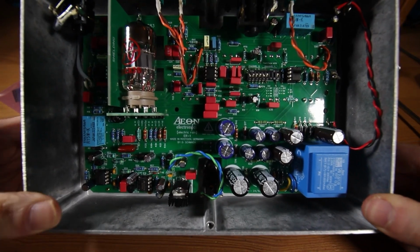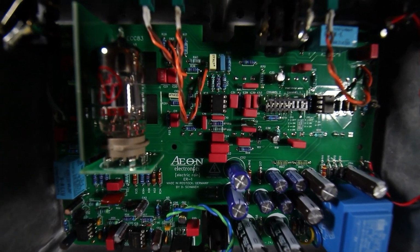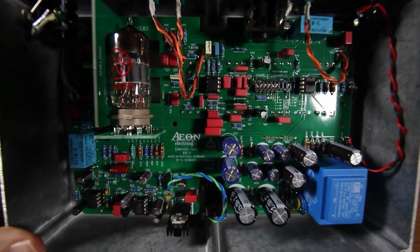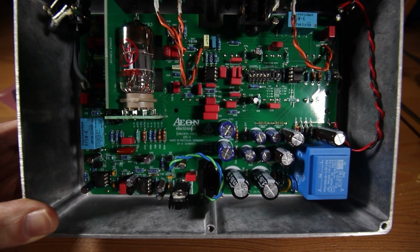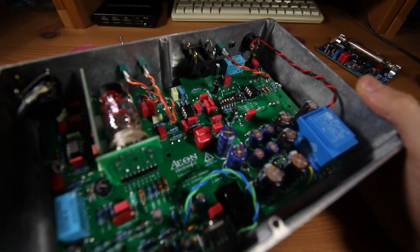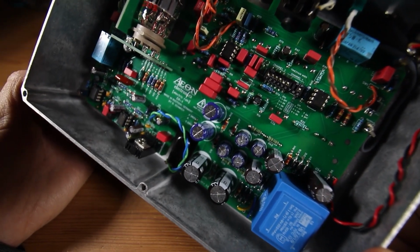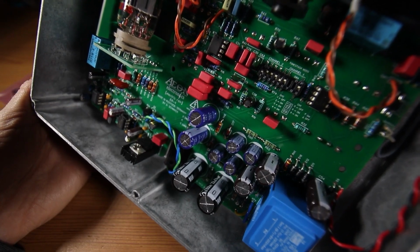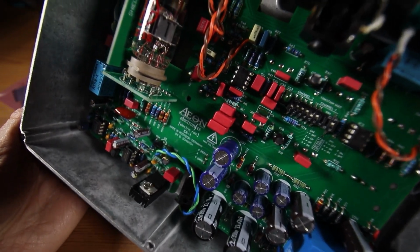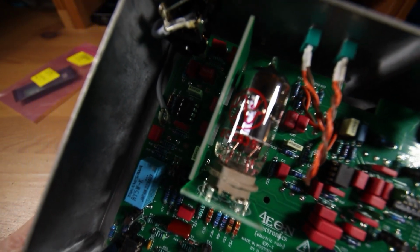And of course it should be a 2-channel design with gain, volume and EQ section each. The channel switching must be noiseless, so no popping noise at all. And my last point, no microcontrollers should be involved. The whole circuit must be repairable, only off-the-shelf parts were used. So it's pretty obvious that I have to do a complete redesign. Sorry Hughes and Kettner, it is no longer a Tubeman.